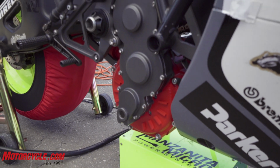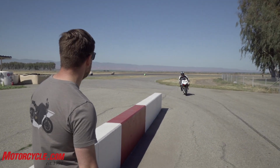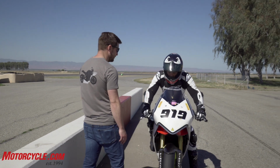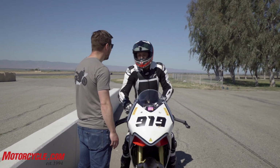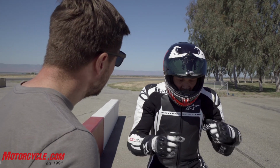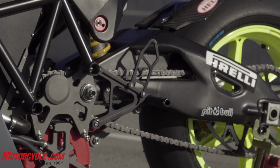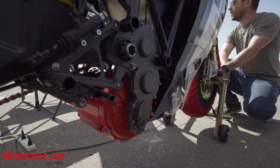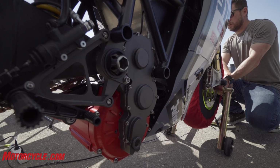They've been a great partner. They do, as a matter of their normal business, come up with a custom winding for the motor. So this bike has a custom winding. They come up with a custom length for the motor, and essentially what we've done is we've taken an off-the-shelf motor from Parker and then adapted custom end plates on either side that include a gear reduction ratio on one side and then a cooling plenum on the other, because the motor is water cooled.